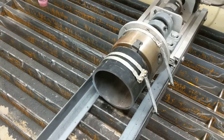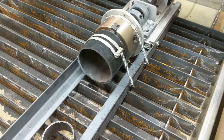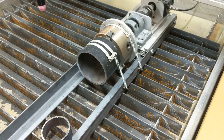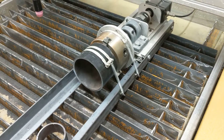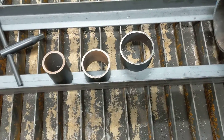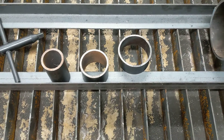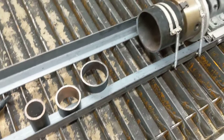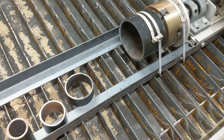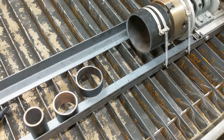That should hopefully solve my problem. I'll maybe nick down to Bunnings tomorrow and get some springs and might try my first rotary pipe plasma cut. These are the pipes I'm using, and I've got a different profile for each setup in Mach 3, as I'll be unrolling my cuts to a flat surface. I've already switched over the rotary axis to be my Z-axis inside Mach 3. Thanks for watching.